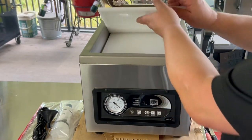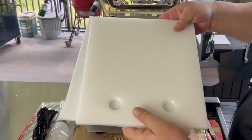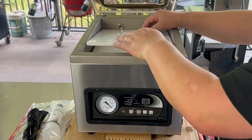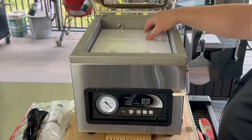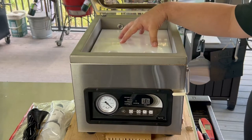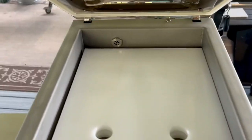It comes with a squishy test bear just to show you they tested it. It also comes with your initial supply of oil, because this is an oil-based pump just like the Vacmaster VP215. Comes with a little funnel and your cord. And it has two filler plates, which help when you're doing smaller items — they fill up the space in the chamber so you don't need as long a vacuum time, and it'll pull a stronger vacuum because it's pulling out less air.